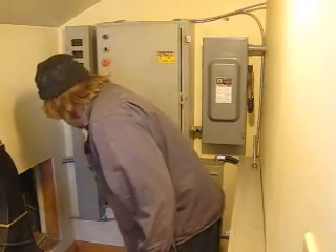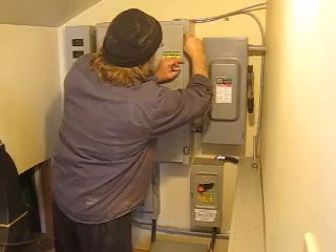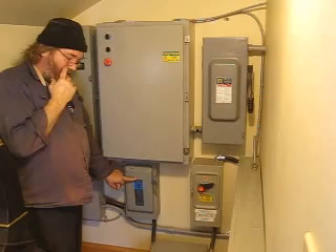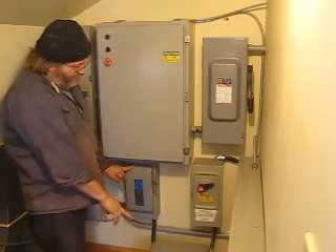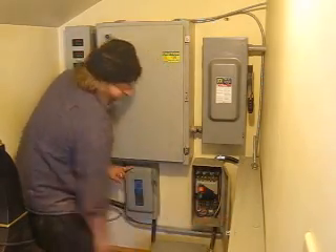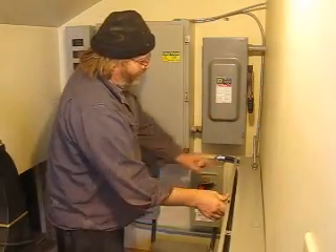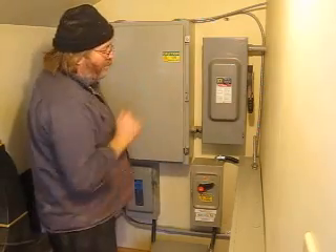That's the 240-volt system, which requires no transforming of power. I also have 600 volts. Out of the 240V bus box, I'm feeding a 600-volt-rated disconnect, which feeds a 9 kVA transformer — 600 to 240 volts. Out of that transformer I'm feeding a fused disconnect to a 600-volt bus box, which livens up three bars. We can feed 600 volts for up to nine horsepower worth of machines, and it's fused.